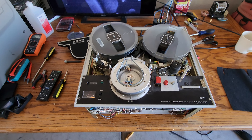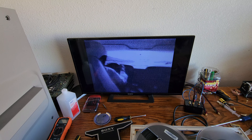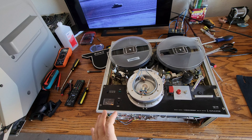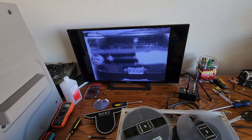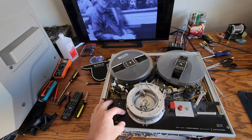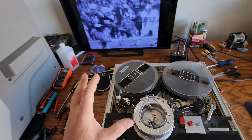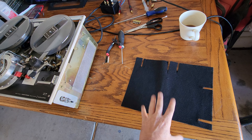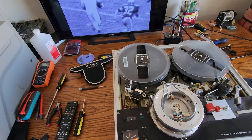The problem with the machine was a tension alignment issue — not enough tension, not enough alignment around the drum, not enough torque for the video head to penetrate the entire scan and stay in frame. That's usually the situation with these machines since they don't have automatic control tracking; they have automatic gain control tracking when you record, but not when you play back. There is no adjustment for tracking on these. I've been working on these for a very long time, so my suspicion was the tension was wrong — and it was. We ended up fixing the tension and put brand new drag pads on it, replacing the old ones because they were worn out. You want to make sure you have enough tension on the tape during playback.